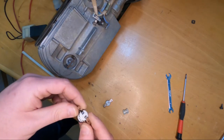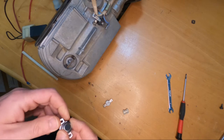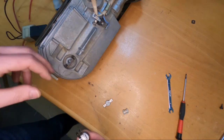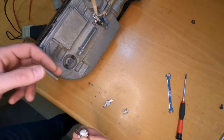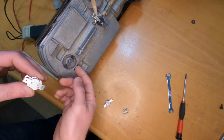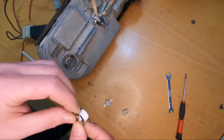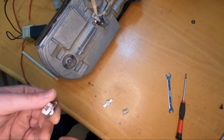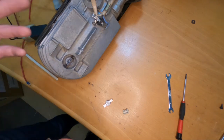This sensor tells the ECU that the unit has started when it reaches about 80 degrees Celsius — this is when the switch opens and the ECU detects that it has detected flame. I just have to find a way to mount it here. This is a metal piece which we somehow need to insulate from the sensor, so I will take this down from the sensor because we don't need it. I have to find a way to put it here so we can test the unit and see if it is detecting the flame correctly.